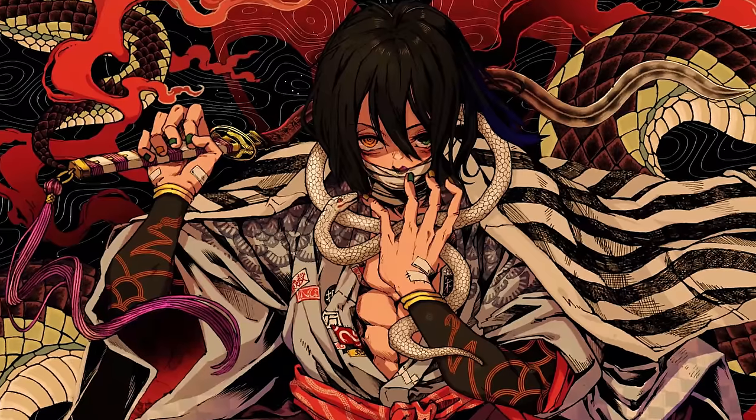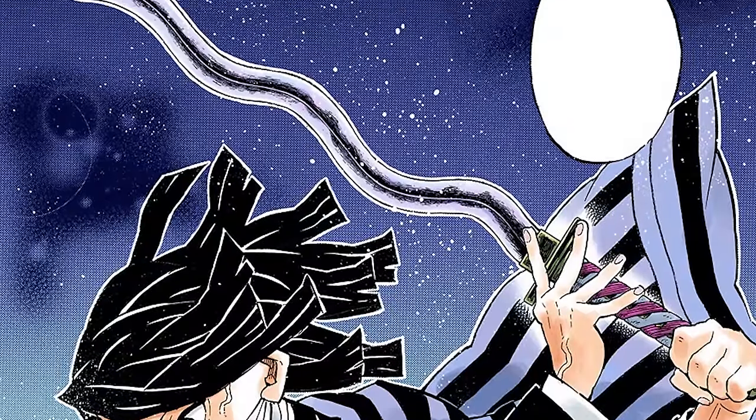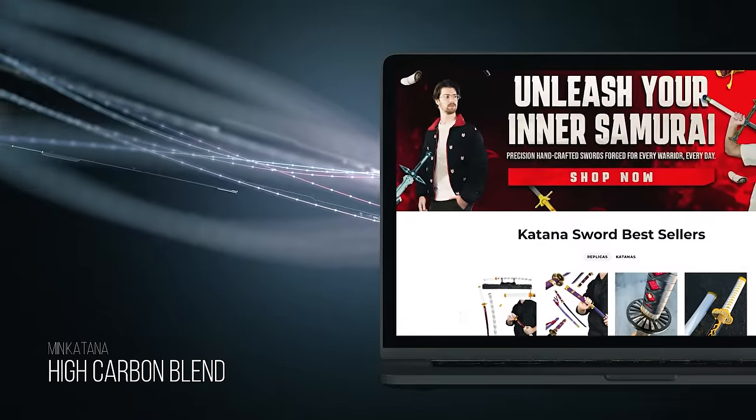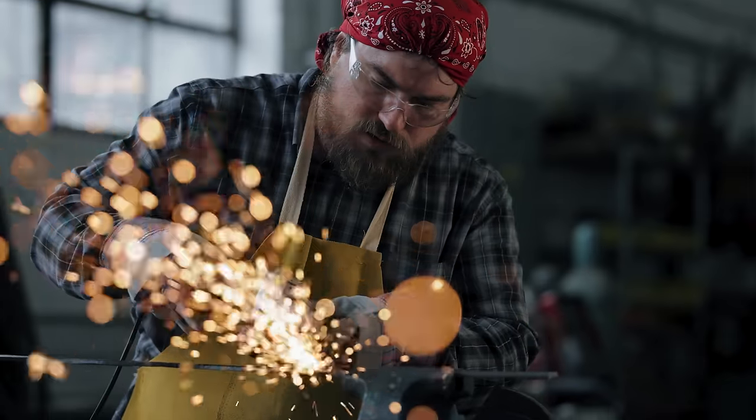This is not just another day at the forge. This is one of the most unique swords we've ever tried to create, and every wave has to be the exact same length. The accuracy we will need will be insane. Even though it's a wavy sword, it still has to have a straight blade. We're going with a high carbon blend known for its strength and durability. The cross section is a six-sided double-edged sword, and if we use the wrong metal, the sword might snap in half.